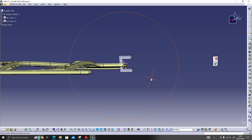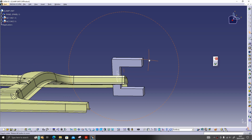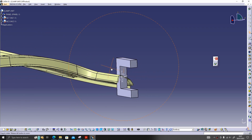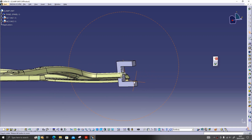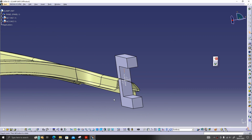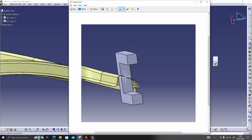Since this is a concept, I'm not going to do any 3D finish, holes, and I don't have shimming either. I will just give the 5 mm spacing for shimming, so it's understood it's for shimming. Now we'll plan. As I said, it's more than 15 degrees, so by default this is one-way shimming, and since our NC is getting chopped in this way, this shimming is required.